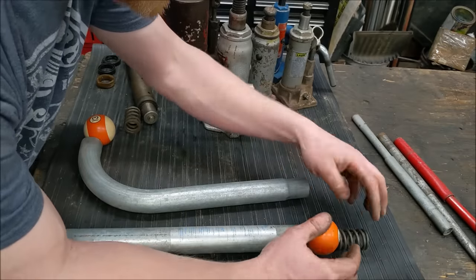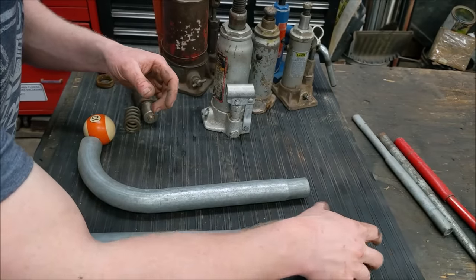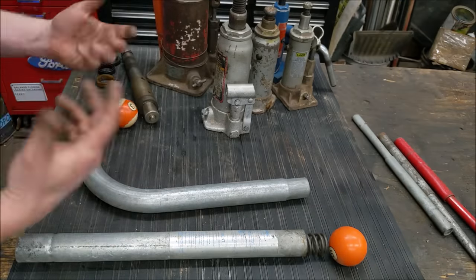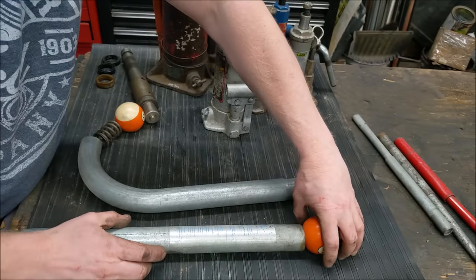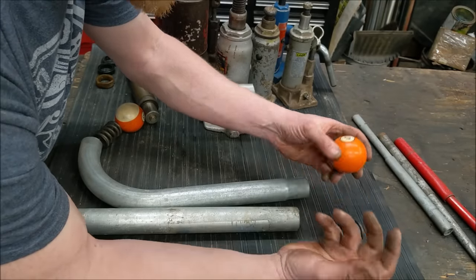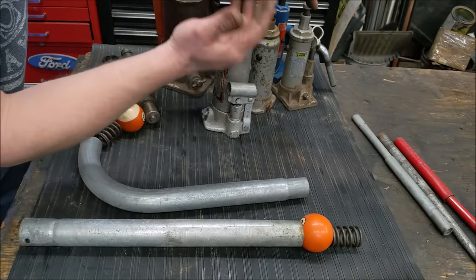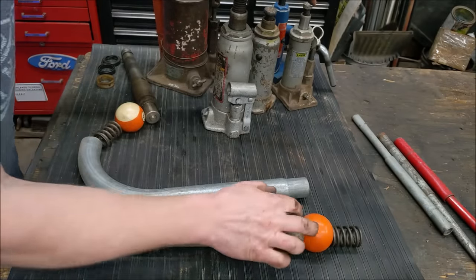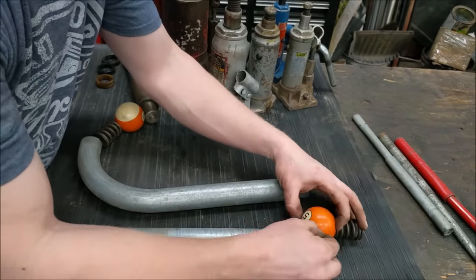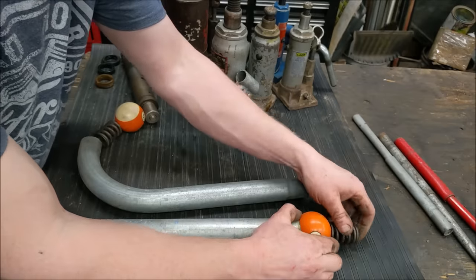There's a lot of mystery behind these, and a lot of times people put the check balls in backwards — I've seen so many where people put them in backwards and they do absolutely nothing. One of the reasons they fail is the ball has pitting or rust specs on it because water got in. It's not making a tight seal. So if you pump and it's not really pumping up, fluid could be running past that ball. Taking the ball out, cleaning the surface where it seats can fix it.